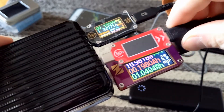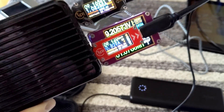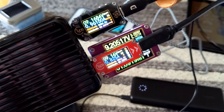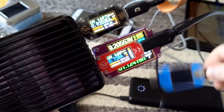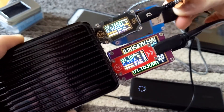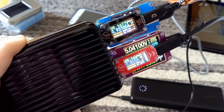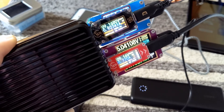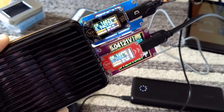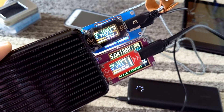We're still at 9 volts. Based on the patterns we've seen, when I plug in the tablet, the quick charge — see the 9 volts — it's going to drop back down. Yep. That's a problem with the way they have it set up. But if you need to use quick charge, just use that one 18 watt port and don't use the other port at the same time.